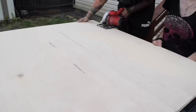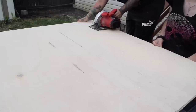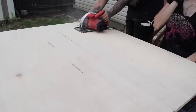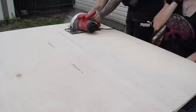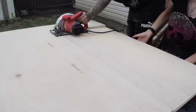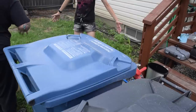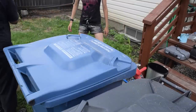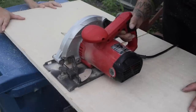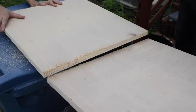We've got one of the cuts done. We're going to cut it down the edge as well and then do a third cut just down the middle. We made two bases because we're planning on making two separate ones — one for the front room and one for the bird's room — but you only actually need one. Don't tip the whole chunk of wood towards you or you'll get covered in sawdust. Our final cut is straight down the middle, which gives us one nice solid square to use to support the base.